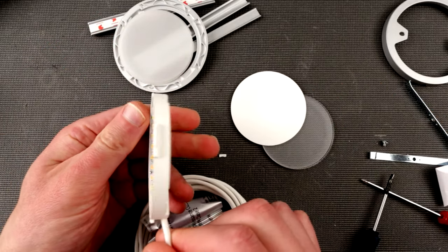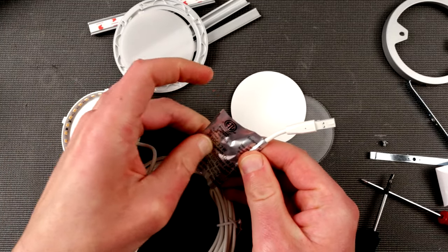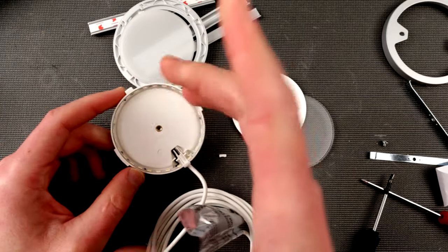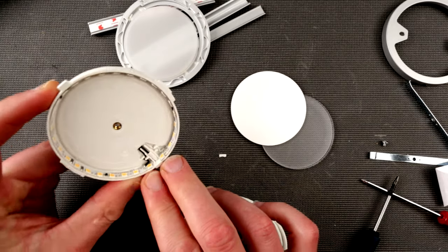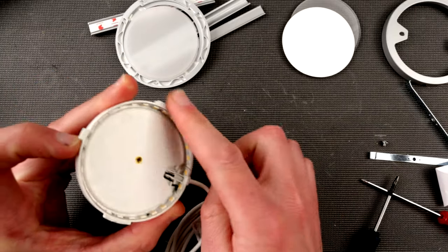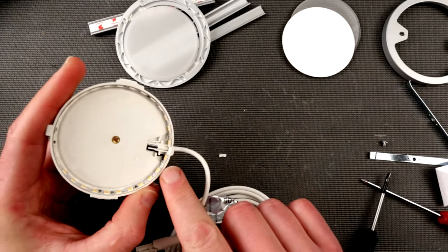But I think I like this orientation of those LEDs. Does it say 24 volt 2.2 watts? We can calculate the current which actually passes, or we can measure it. We can measure it with my power supply. I can connect 24 volts probably even straight here without any shenanigans and power supplies. We can take a look how much this thing consumes, and obviously knowing the number of LEDs, we can calculate how many, actually measure the voltage drop on each LED.